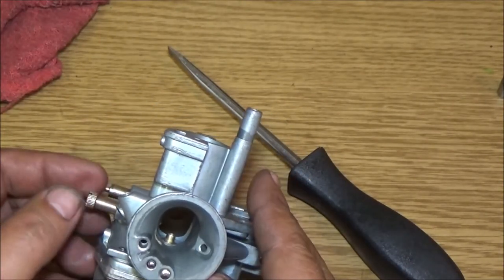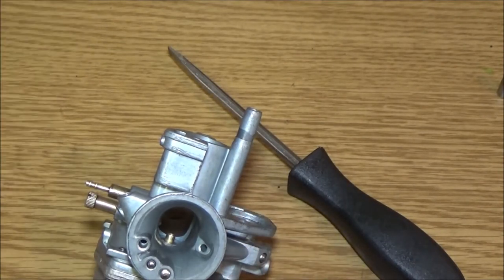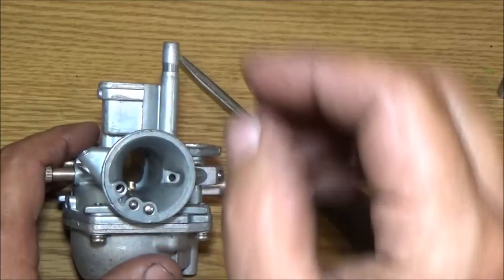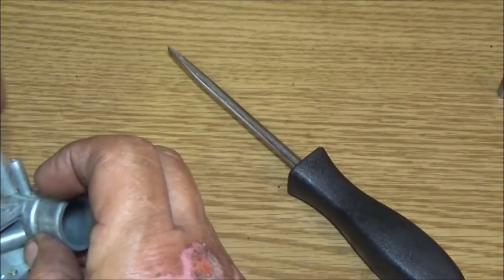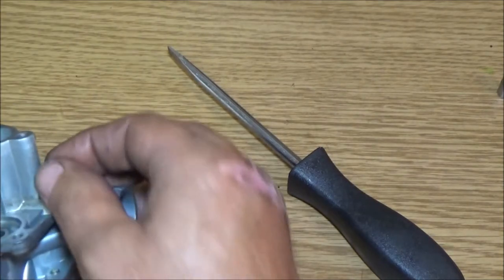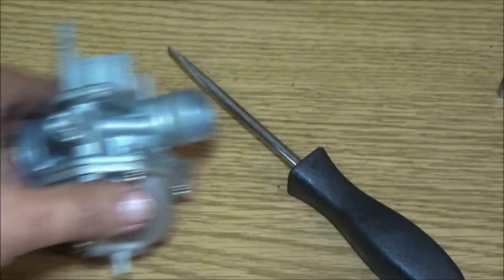Now this bike is two-stroke, of course. I've mentioned that before several times, but you don't have to mix gas and oil. It's got its own oil tank and it injects, it mixes itself. But just in case there's an issue with that, I've got to make my little block off for that. I'm going to mix up some two-stroke gas, and I'm going to mix it heavy, 50 to 1, because that thing hasn't been running in a while.